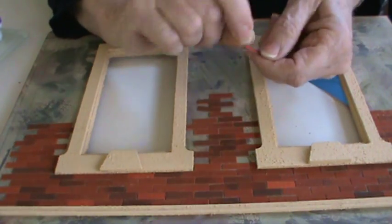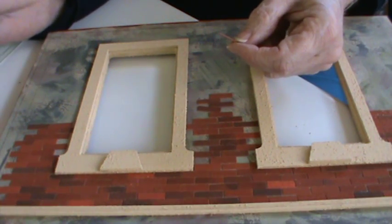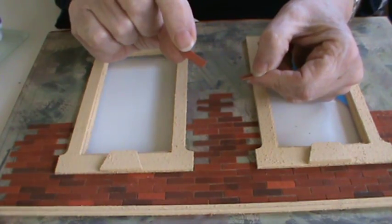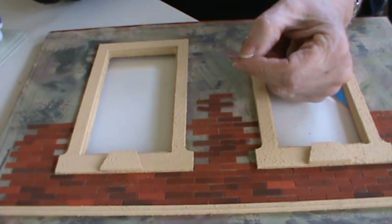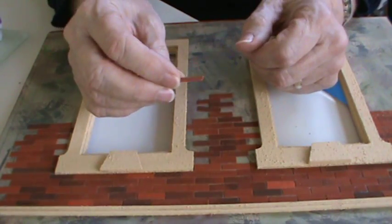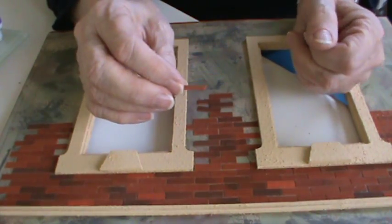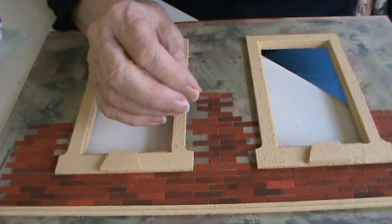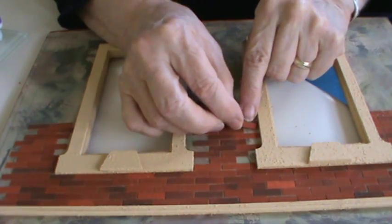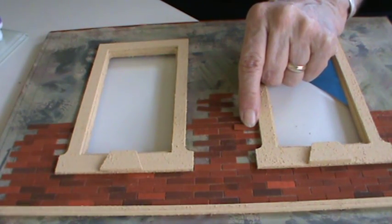There isn't an upside down and a right side up, because they vary front and back. The colours will vary. And another tip, don't try and create randomness. Let random be random. Put your pile of bricks beside you, pick them up, stick them down, whichever way up they land in your hand. If you try to randomise them, they end up then looking pretty much like a pattern. It's a hard thing to do. We don't have random brains. We do have patterning sort of brains. So don't do that. Just pick a brick up, put it next to the space that you're going to fill.